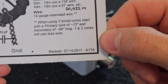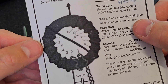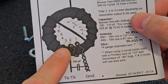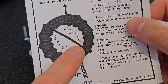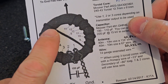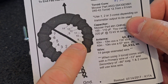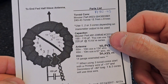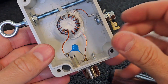The reference is Kilo One Tango Alpha — put that callsign into Google and you will find the winding plan. So you can see two twisted wire turns and another 12 turns. It's very important that the 8th turn goes through the hole of the entire toroid — the 8th turn passes through the hole and appears on the other side, then you continue the remaining turns, and the end of the wire goes straight to the antenna connection.